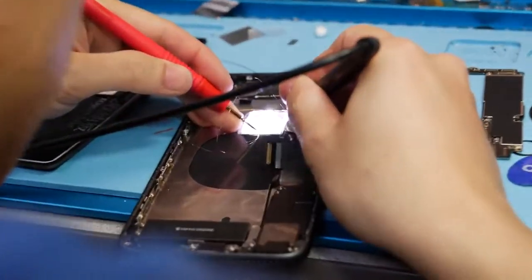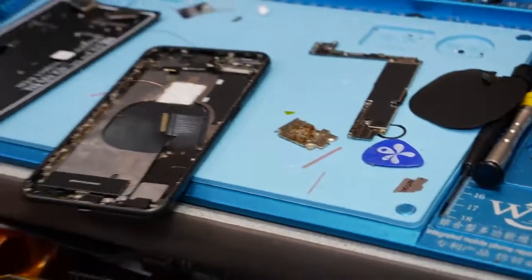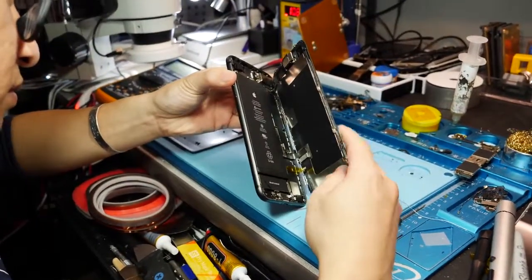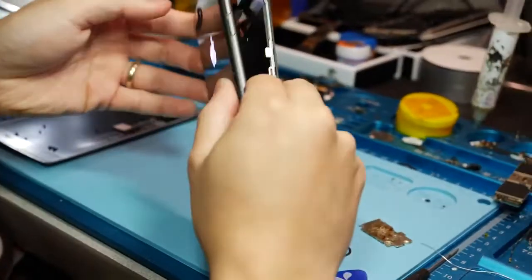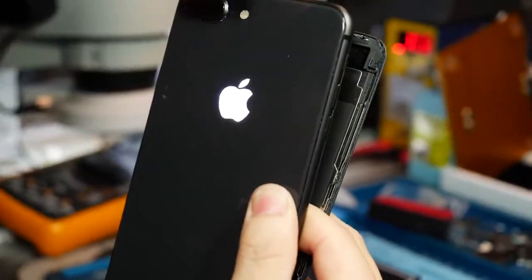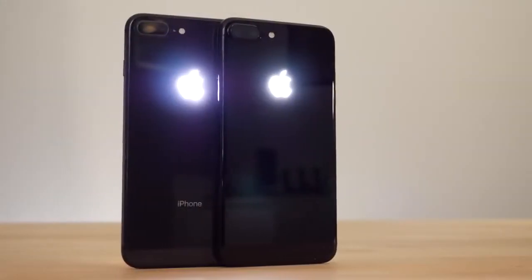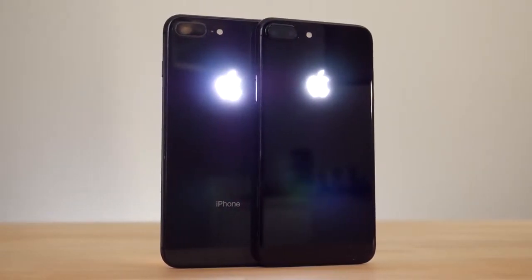Very similar process to the iPhone X here — we still have to cut into the metal if you're doing it from the inside. Otherwise, if you want to replace the rear glass, you don't have to cut the metal. We do have the white LEDs here — looks very clean with the space gray. I really wish I had that on the iPhone X, but that's not an option. This is my preferred combination, and it's actually even brighter than the iPhone 7 Plus version because we're not shining through an acrylic Apple logo — it's going straight through the glass. The light is very distinctive — you're definitely going to notice it walking down the street, and the darker it gets, the more it becomes like a flashlight guiding your way.